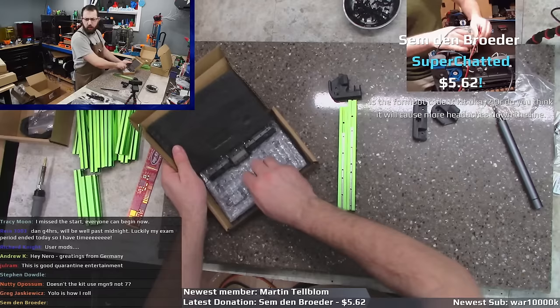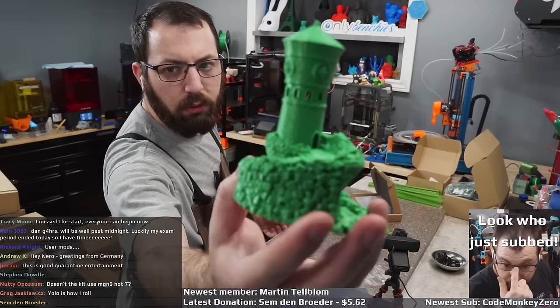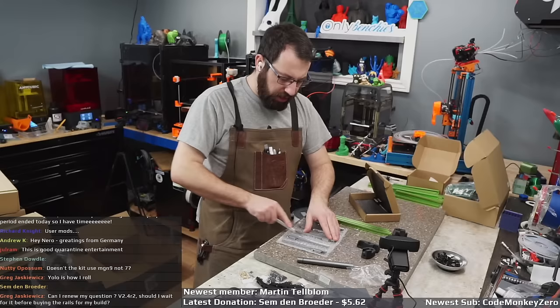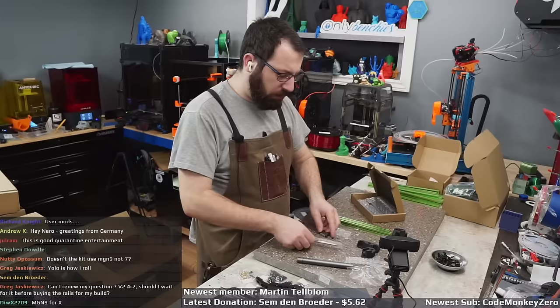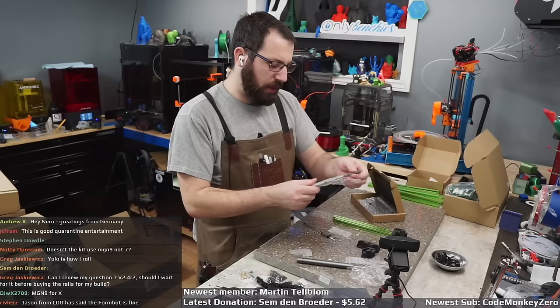Is the Formbot Trident kit okay, or do you think you'll cause more headaches down the line? It's printing. I printed this guy last night on it. Just a generic PLA print. I'm just trying to get hours on it before we do the final tuning. But hardware-wise, the kit was fine. The electronics are pretty basic. It's a pretty basic kit for electronics. You're basically doing it all from scratch. It comes with enough wire to wire everything up, but they're assuming you're running wire directly from the tool head all the way down without connectors, which is kind of a no-no. So yeah, the hardware of the kit, though, was pretty okay.